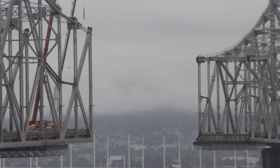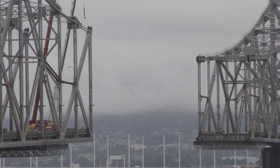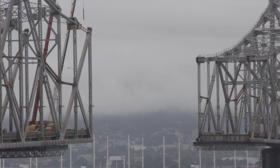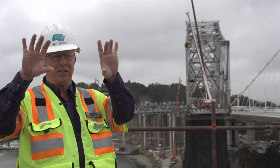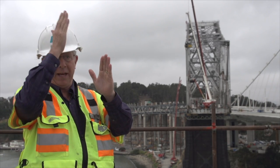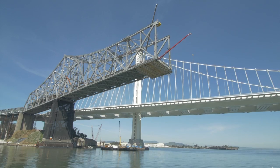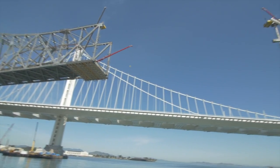You don't want that to happen. So, for instance, if a member has a lot of tension in it, what you do is put detentioning devices on each side of where you're going to cut. You jack those detentioning devices together a little bit, which relieves the stress in the member. Then you make a cut, and the whole process is very controlled.